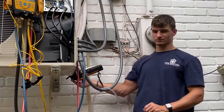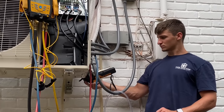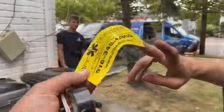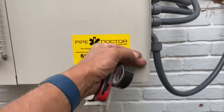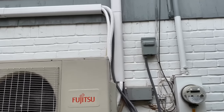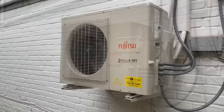Good old Air Force None using the NAVAC automatic flaring tool. How do you like that thing, Christian? Almost done and it's 12:30 — finishing touches one-handedly, right before the rain too. We're at 115 microns. We didn't have another flat elbow, so for now it is what it is, but it's nice liquid tight, really nice.